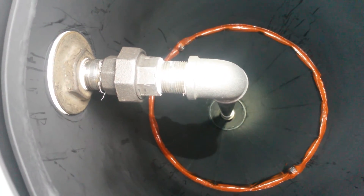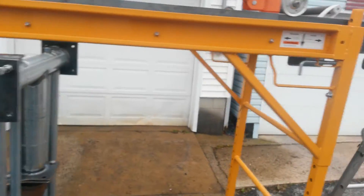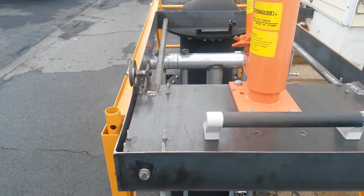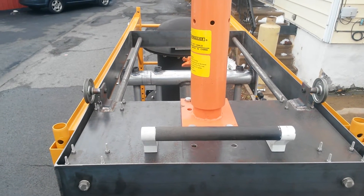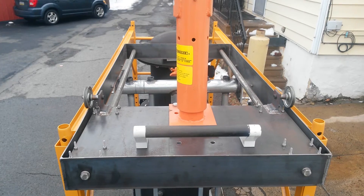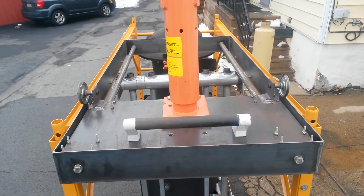Another thing that I missed in the last video: on this crane assembly I did a little upgrade. I actually put rollers on the sides — I have brackets that are welded in place and shoulder bolts that go through those brackets to hold those pulleys in place. What that does is it allows me to lift heavier objects with this crane without flexing that one-inch round stock too much. That greatly increased the amount of weight I can lift with it, because it actually rides on a track on top of this frame. This all has to be torn apart and painted, but that's down the road.